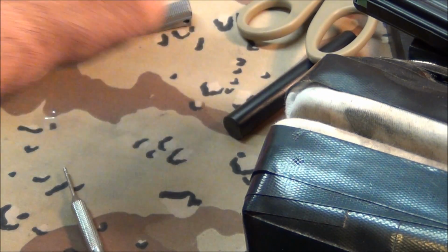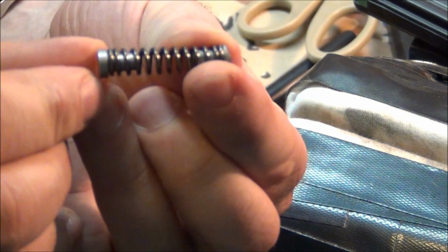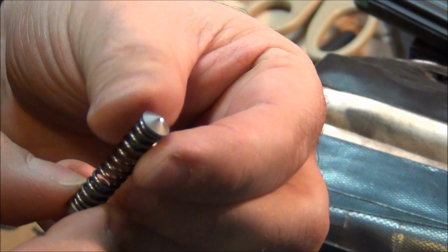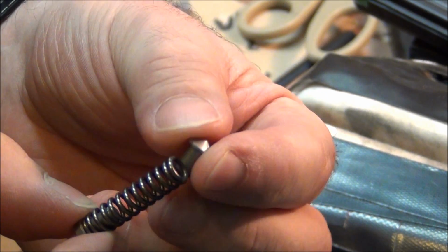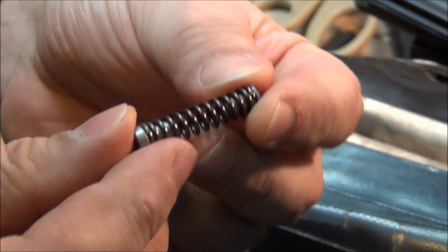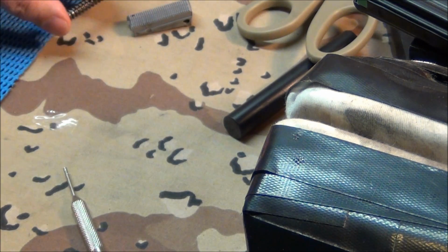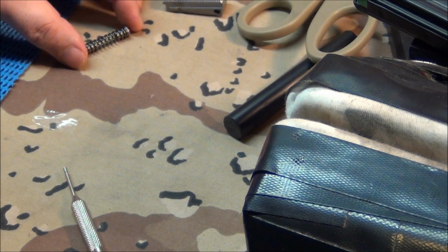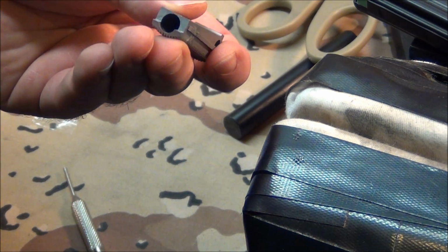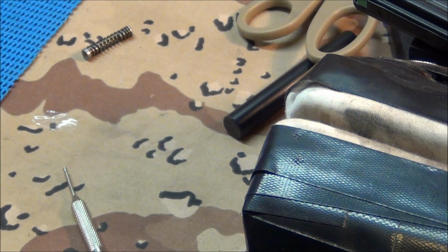The mainspring is a 3-piece set. You got the top cap, which is this, and you got the tapered bottom, which comes to a point, and that goes to the bottom. And you just put it together. And the very important thing is lubrication when you're putting in a metal mainspring housing. Now when you have a plastic one, you should lubricate it, but you don't need it. It's not as severe. When you have a metal one, you got to lubricate it.